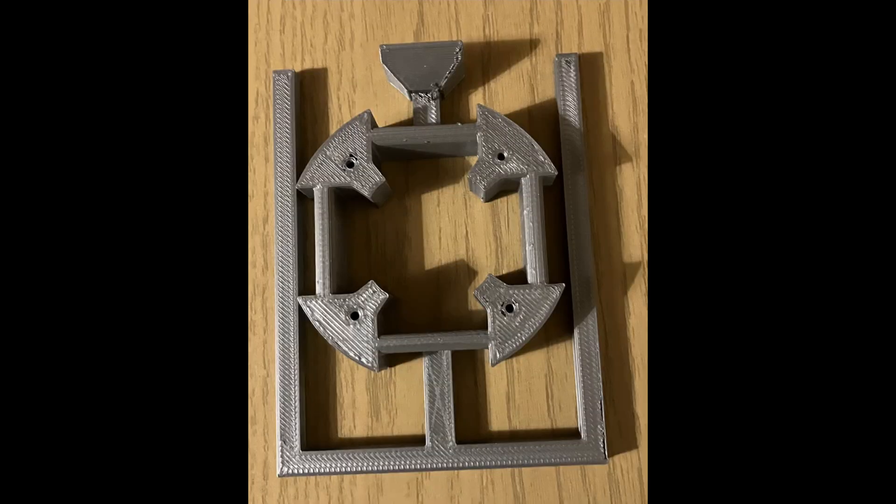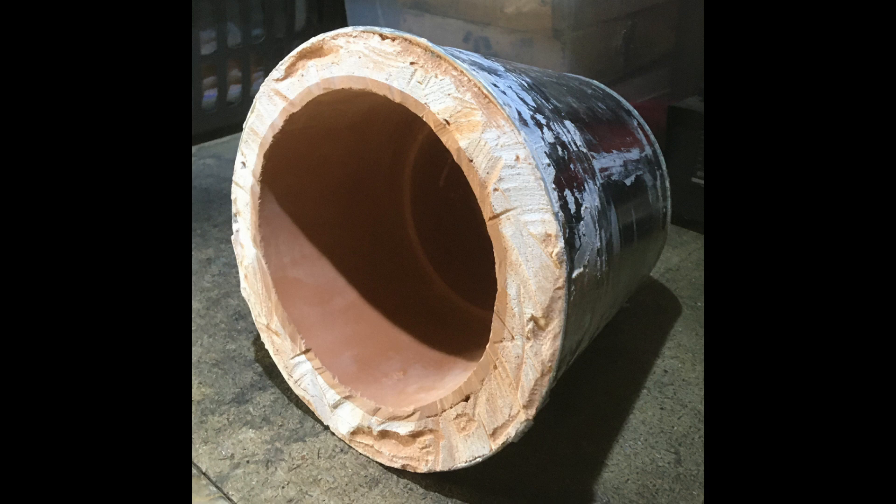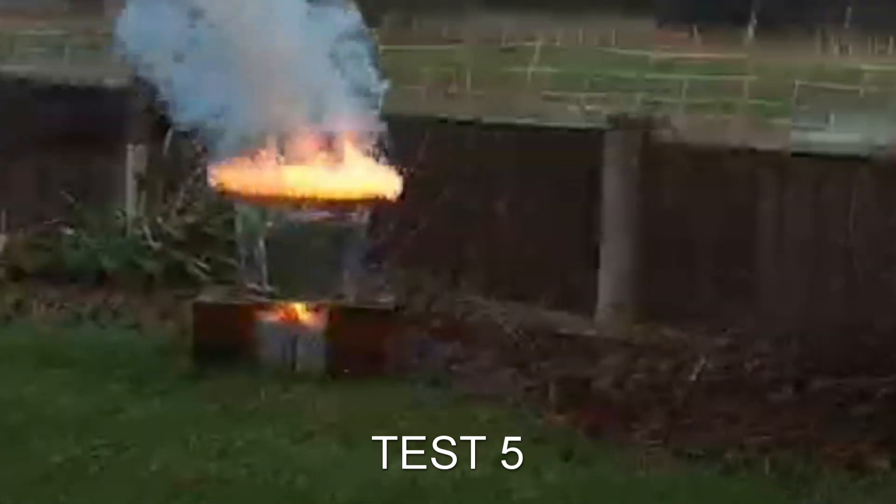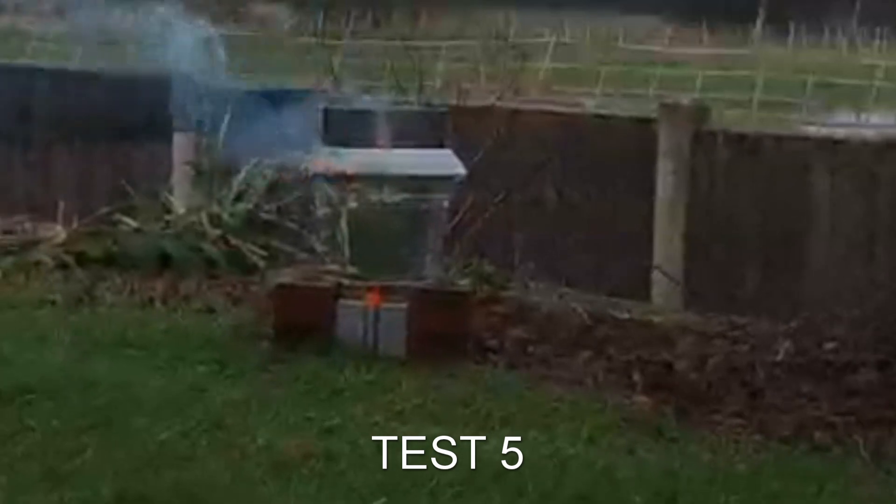For test 5, I reduced the size of the pattern for the mold by 3D printing a smaller PLA plastic version of the armature I wanted to make. I also put a clay pot inside a metal bucket with a plaster of Paris and sand mixture. The plan was to make it reusable and turn it into a mini blast furnace later. Unfortunately, I should have made a funnel in the bottom of the clay pot, as most of the molten iron collected on the flat bottom and never entered the mold. I made the modifications but never made test 6, as I saw an advertisement from Xometry and realized I could just get the part machined for me.